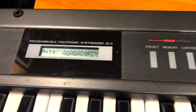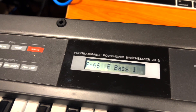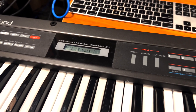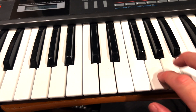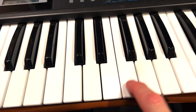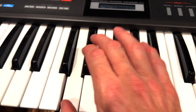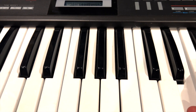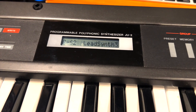Obviously the battery is dead. You can see the memory is corrupt on the memory side of things, although the preset patches still load off ROM. And you can see I'm just playing some of the keys here, and there are some dead keys. So that was the first thing I noticed — not all the keys work. I've fixed keyboards before on D50s, Junos, JX10s and such, so I've seen some of the problems with this sort of key bed on the Roland synth.